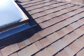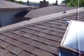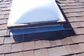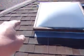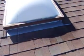This is the upper roof inspection. I'm going to be inspecting it from the ridges only. So I'm not going to work out onto the field apart from this part here where I've mounted the roof. Here we've got a skylight. And the nails protruding from the skylight here around the flashing. They should be driven in.